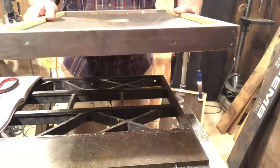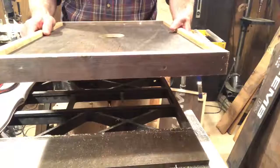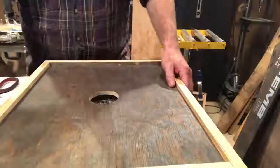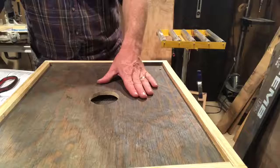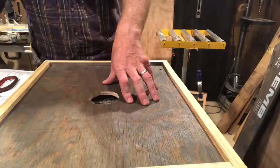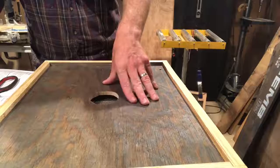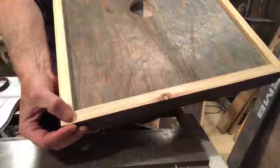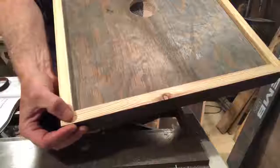There it is. You would put your honey super onto this side, and the bees would clamber down through the two-and-a-half-inch opening, hit the hardware cloth, and be naturally directed out one of the three exits into the box below. You'd come back the next day and hopefully find a super full of honey with very few bees. I hope this showed you that you don't have to have a workshop full of tools. Don't let not having a table saw, miter saw, or air nailers stop you — start where you're at with what you've got. Don't sweat it if you don't have a dado blade either; the bees won't care about a flush joint. Do the best you can, do what you can, where you can, when you can.